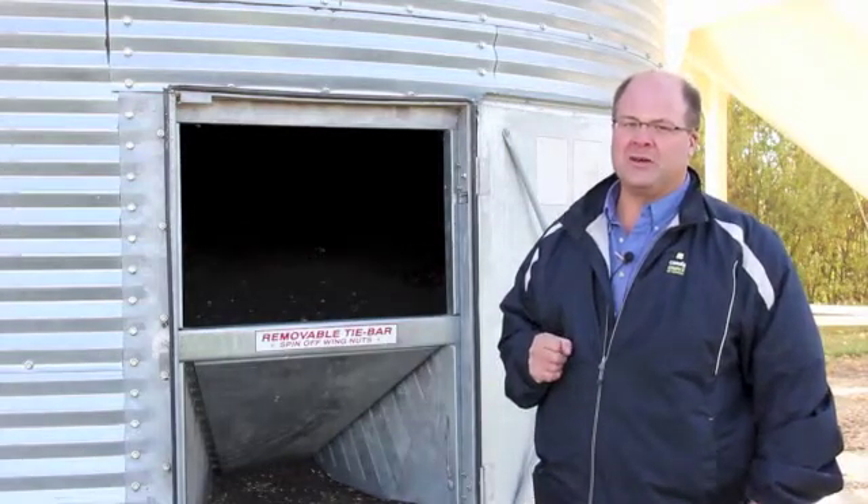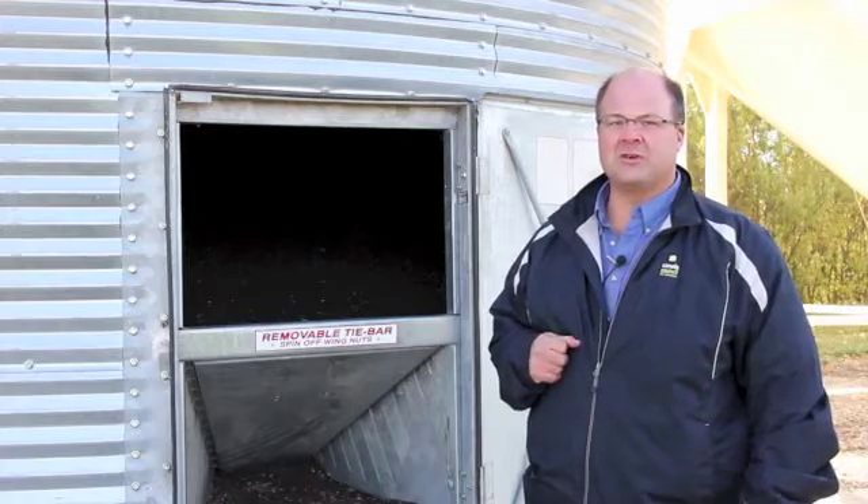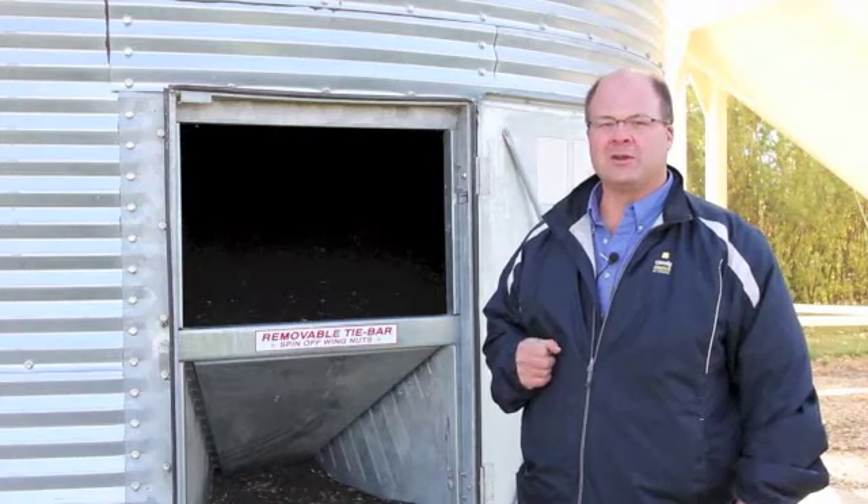A bin like this is going to have around two thousand bushels of canola in it, and we're not likely to be able to check it all that well. There's no moisture cables — you're restricted to probing this bin to keep track of what's going on. What we don't want is for a producer to look out on a frosty morning three weeks later and notice there's no frost or snow on top of a couple bins. Canola is a little too expensive to not monitor more carefully than that.